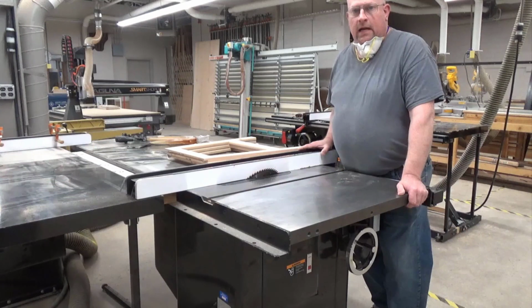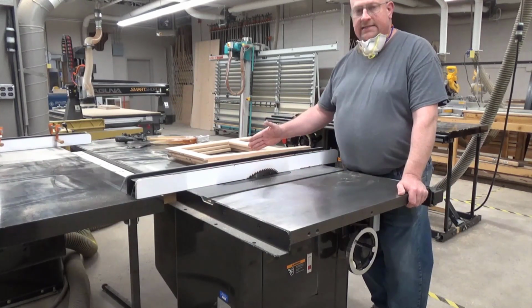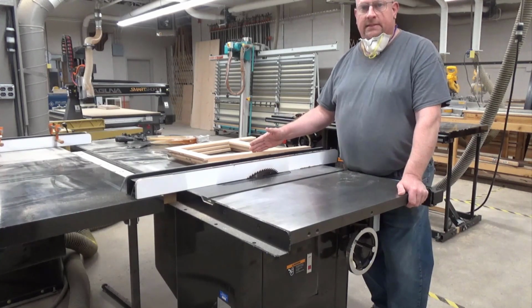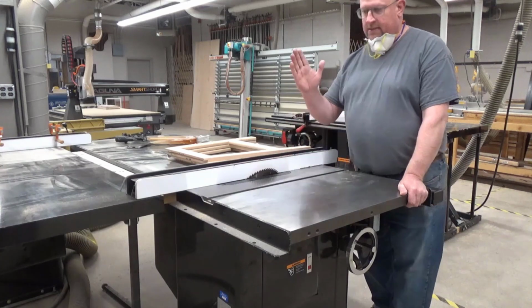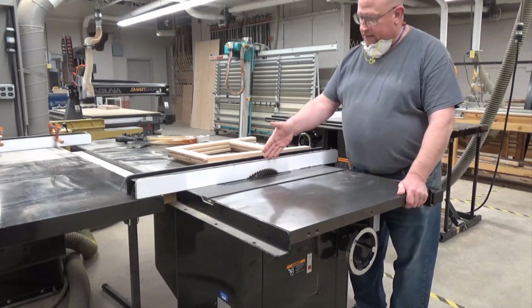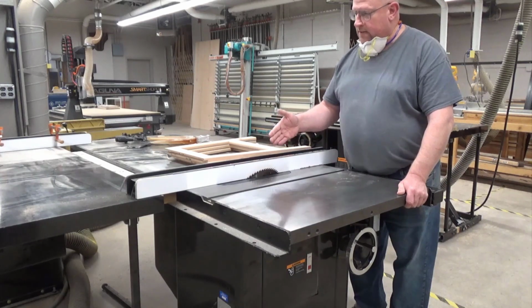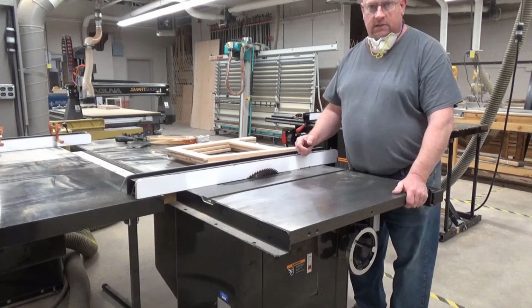Here at the table saw, I'm set up to do the cut on my cricket table leg stiles for the angle to be able to glue up the base in the triangle shape. I have my blade tipped over at 30 degrees, and I've got my fence set for the 0 mark. Notice that the guard has been removed from the saw, so this process has to be done by me. This is not something that can be done by students.